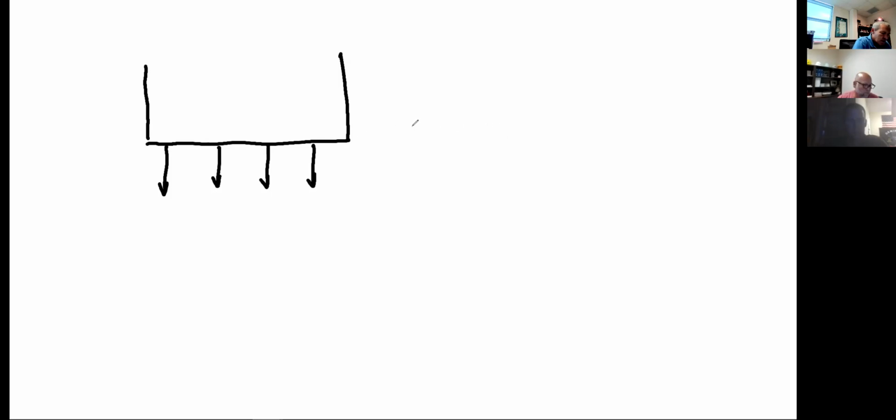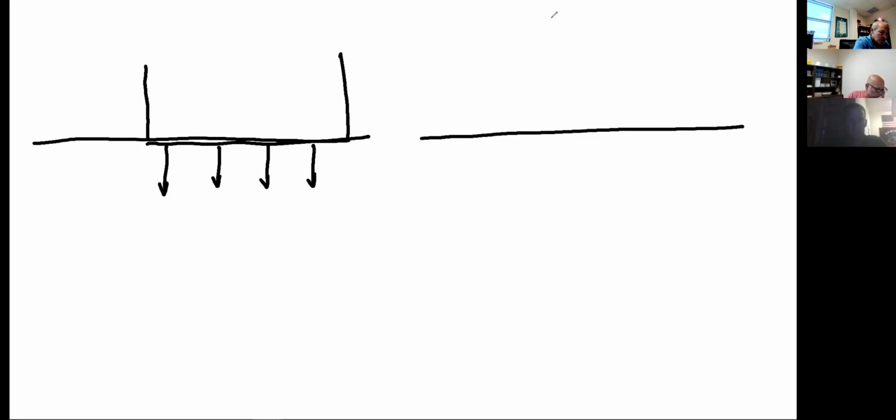Another thing that's going to help in this precision locating, when you've got the wand in a certain zone and you're facing it straight down, is the depth process. Here's my ground level right here. Here's what some people do. Here's my wand, they'll press the depth key from where they're standing. Well, this is 3 feet deep and this is 1 foot off the ground. What measurement are you going to get on the wand? 4 feet, when it's really 3 feet in the ground. Make sure you put the wand on the ground.